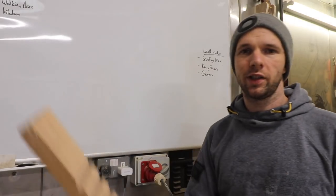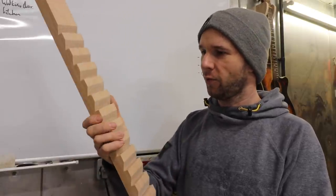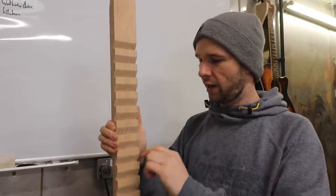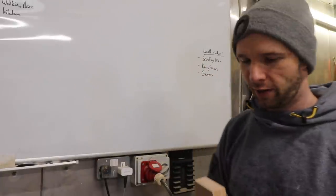That's pretty much it, guys, in terms of the machining for the shelf strip detail on this sawtooth section. Before you rip them down, remember that it's best to put a finish on this inside edge here so that you can sand it in all the grooves before you rip them all down into a million different little bits and really struggle to get a finish on that.